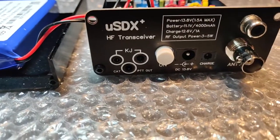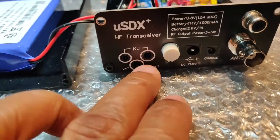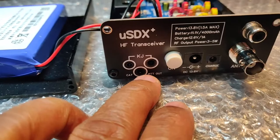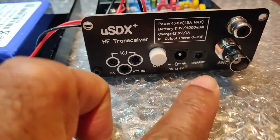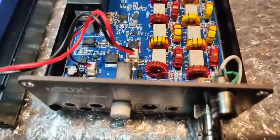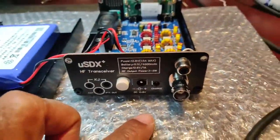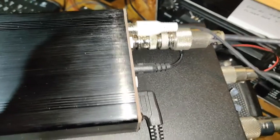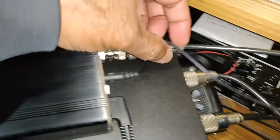This is how it looks from the back. As I said, this is the PTT out / CAT plus PTT out — one of the contacts is the PTT out. That is the contact I have taken, routed underneath to the top by drilling a hole as you saw, and then connected to the center pin of this RCA. It is now connected to the amplifier — you can see the RCA jack here.